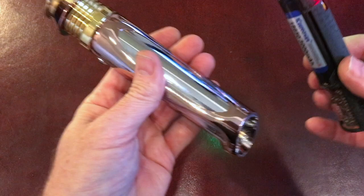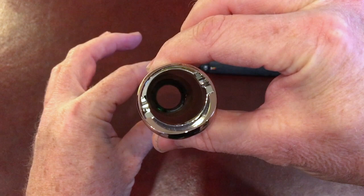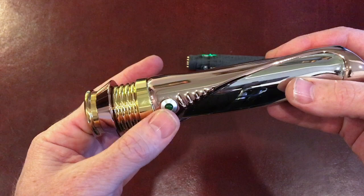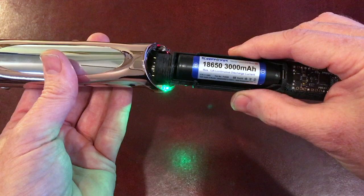So to get it back in the hilt — if you look on these buttons, these are little plungers. There's a little retainer inside the hilt to stop those plungers falling through. The tolerances are quite fine, so on some of them it's possible for these to just pop through. So they need to be sticking right out like that when you put the chassis in. It's best to hold the chassis upside down like that. Make sure those plungers are sticking outwards, and with your LEDs facing downwards, you can slide the chassis in.